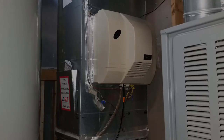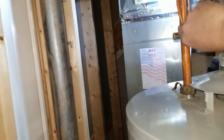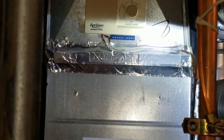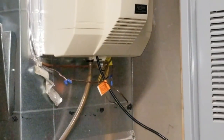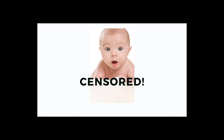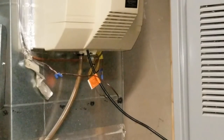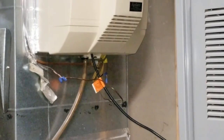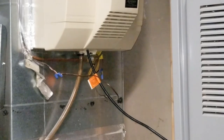Reverse the process — plug it in, open the water valve, and turn the humidifier back on. We'll set it for around 20 degrees average outdoor temp in the winter. Around here we start out around 35 percent. If you ever see condensation on the windows on the inside of the house, you don't want that because you could start growing mildew. Just turn it back down from there. The gauge on the humidistat is just a suggestion, but it usually works out pretty good.